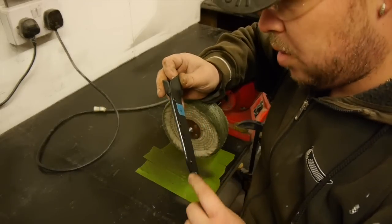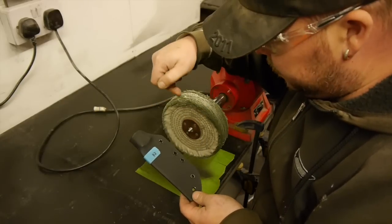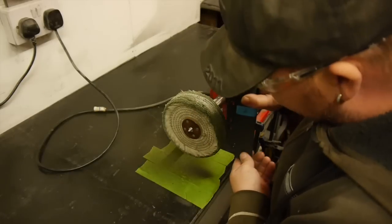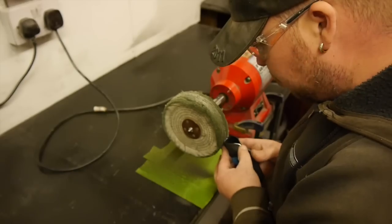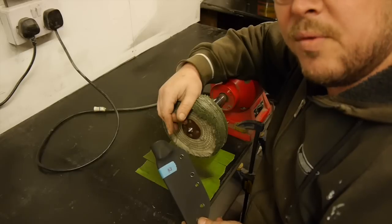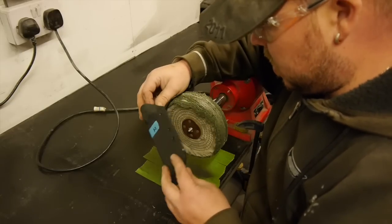Some people can do it with sandpaper. If you haven't got a buffing machine, you can buy these little wheels that go with your Dremel that will do the same thing. You just gently go over and over, but be careful because you can actually mould the plastic and cut into the kydex. If I held that on there now, it would melt a divot in. Sometimes if I want this over a little bit more, I'll apply more heat and it'll mould that over. Then I'll go back, so you have to be extremely careful. I suppose a slower machine or one with a variable speed would be even better. You could just get the sweet spot. Anyway, I hope that helps somebody, and I hope that helps you, Paul.